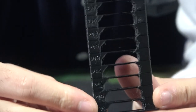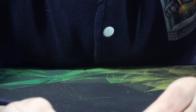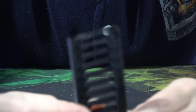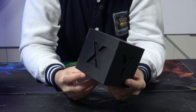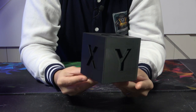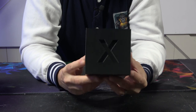We did the obligatory temperature tower, done in PLA. I'd say everything from 225 all the way down to 200 has printed quite nicely. Then we thought we'd go a little bit bigger — a calibration cube printed at 400 millimetres a second, which meant it printed in about an hour and 20 minutes, which is insane.